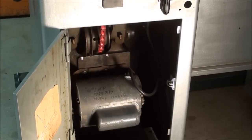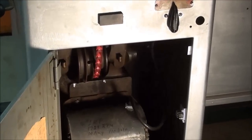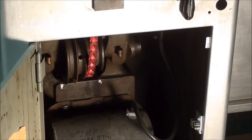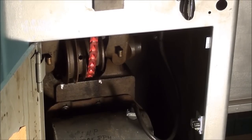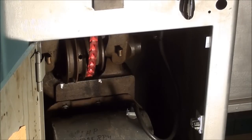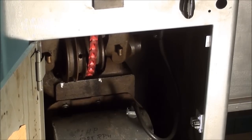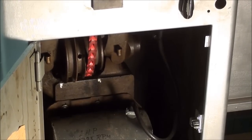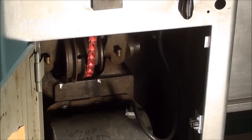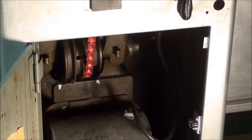If I recall correctly, a couple years ago I had to take the belt apart from the bottom side — the drive side — because there really isn't room on the top, even with the belt slack and pulled over to the side. I myself prefer V-belt drive over flat belt, but you get what you can find, and most of the South Bends I've seen have a flat belt rather than the V-belt. On the bigger lathes, no matter what the brand, if they've got V-belts, they probably have dual V-belts, a dual drive.